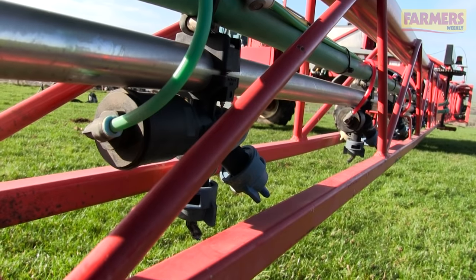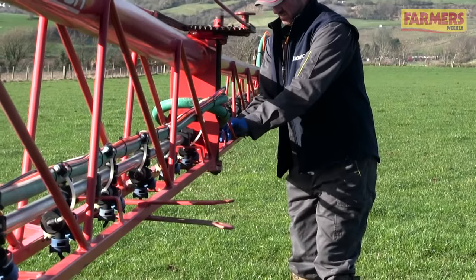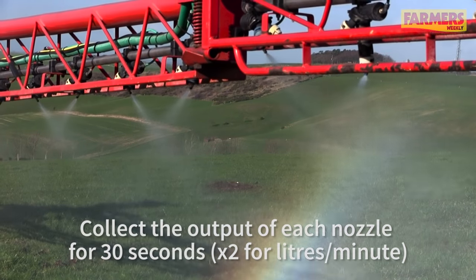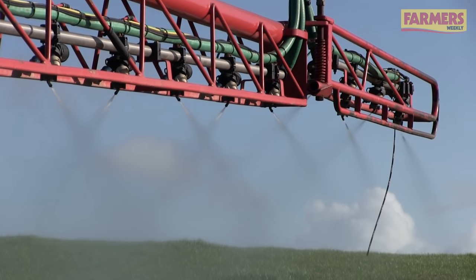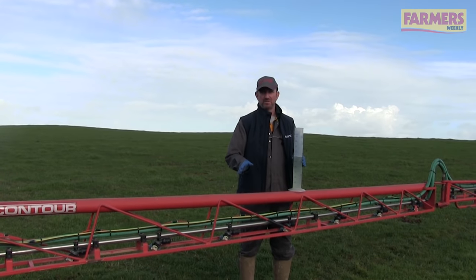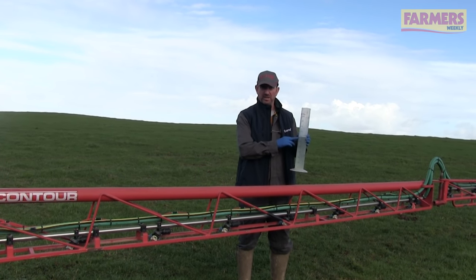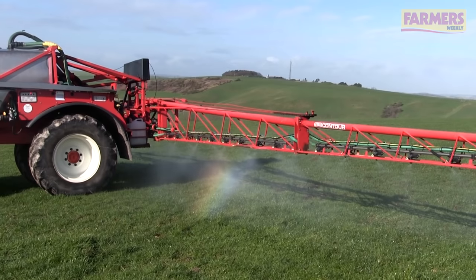Moving on to the actual nozzles on the boom, we want to check that they're in alignment in the vertical and horizontal plane as set out in the NSTS standards. The next thing to do would be an actual physical nozzle output check. We had the sprayer running at three bar pressure and then we put a measuring cylinder underneath the nozzle — not a measuring jug. The difference is you get a bigger deflection over the wider surface area on a jug than you do over a measuring cylinder. With an O3 nozzle at three bar, the output over one minute should be 1.2 litres per minute. An easy way to remember this is: at three bar, your nozzle size (O3) times four gives you your litres per minute output — it works for all nozzle sizes. Ours was perfectly within range. You really want to change the nozzle when it gets to 5% deflection across the range, or if the spray pattern visually doesn't look correct.